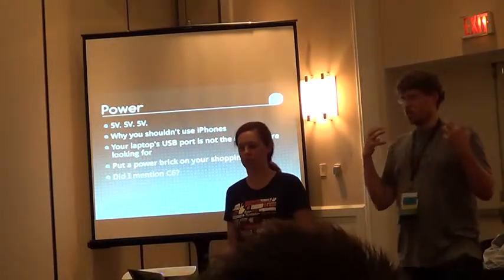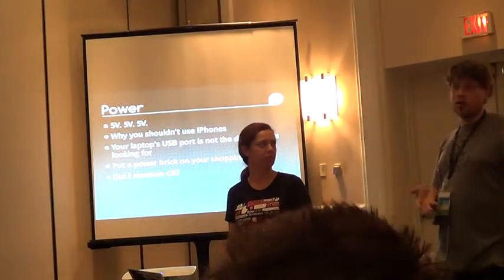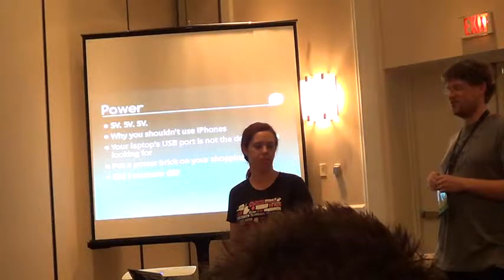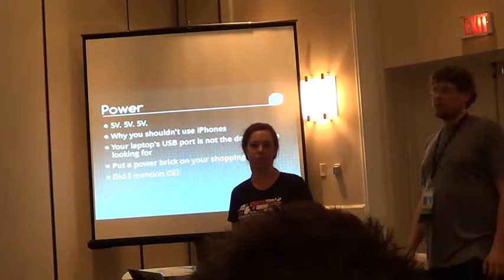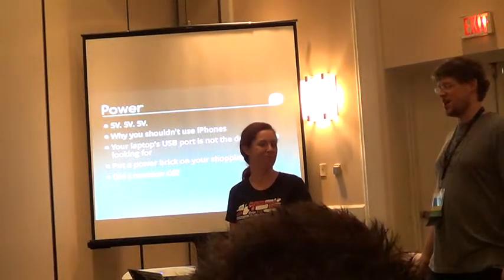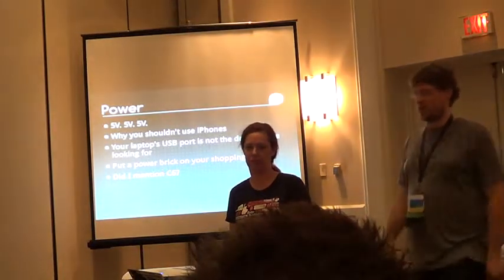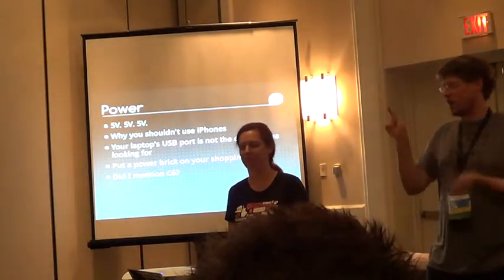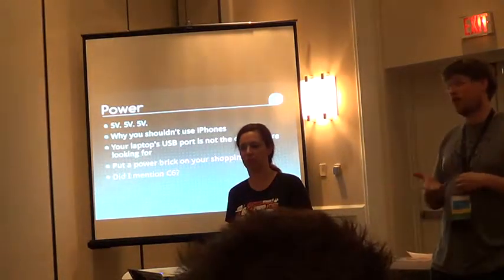Now, USB devices come in two types. You've got high power and low power. All of the ports on the Pi are low power ports. Most of the devices that you buy are high power devices. You can see the inherent disconnect between these two worlds. Now, some devices that are high power are tolerant in the middle and will behave sort of properly. Fancy keyboards fall into the I don't behave properly, so you'd be typing away on your nice keyboard that you don't think is too expensive because you only paid $10 for it at Best Buy, and it seems like a good keyboard, and then all of a sudden it just refuses to accept the T key, and you're like, why is this not working with the Pi? This keyboard is crap. No, it's the voltage difference between the low power device and the high power keyboard that's trying to do this operation.